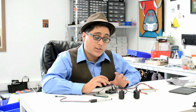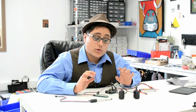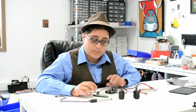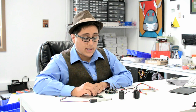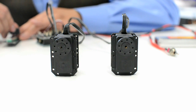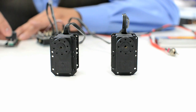Once you attach this and change your jumpers, you can really get a lot more torque and speed out of your servos without having to worry about power considerations. As you can see here, the servo on the right moves faster than the servo on the left — the left is running from five volts while the right one is running from seven.